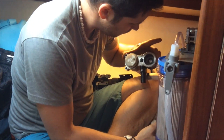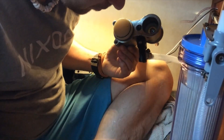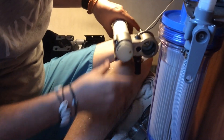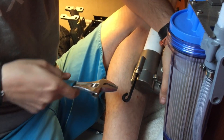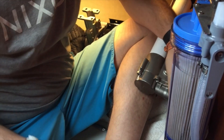For a while I thought it was possible it had a warped head surface on one of the mating caps, but that didn't really seem to be it either. I ended up tightening the socket cap screws even tighter and worked them back and forth a little bit, and 90% of the movement in the pump body disappeared.